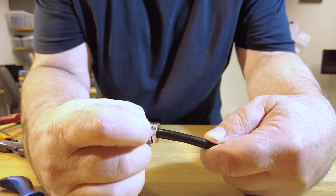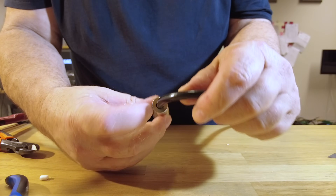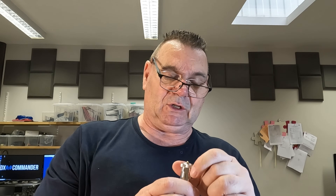We're squashing the grommet so that thread is waterproof back into the coax. The only thing not totally waterproof are the threads. I've been using Vaseline on my threads for years. Let me do a time lapse and I'll put the other end on.